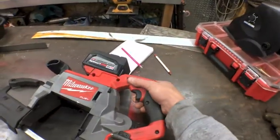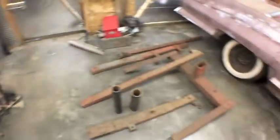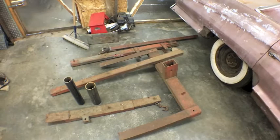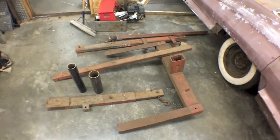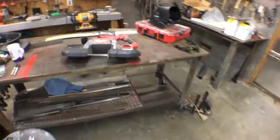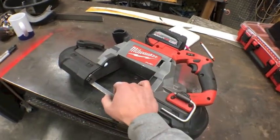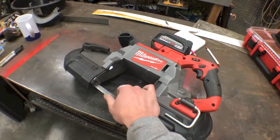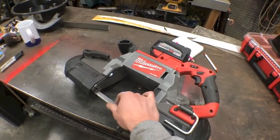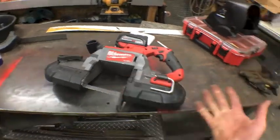You can find port-a-bands on Craigslist used — the corded versions cut amazing. So easy to cut with those things, I can't say enough good things about mine. That cordless one isn't cheap, but you can pick up older corded ones on Craigslist and they're phenomenal. The blades aren't super cheap — I'd say probably 15 to 20 bucks. I'm using an 18-tooth blade. They make different types of blades for different thicknesses of steel and whatever speed you want to run at.